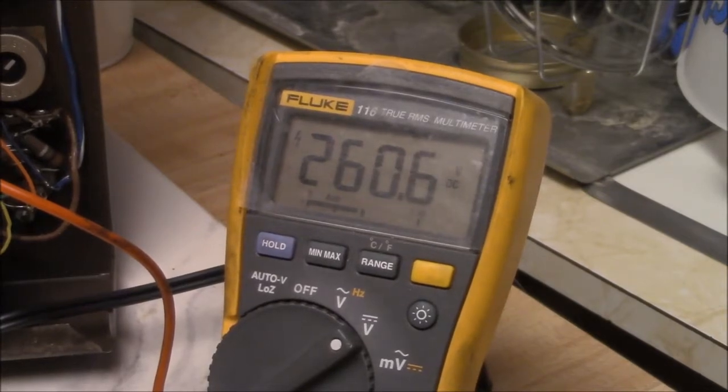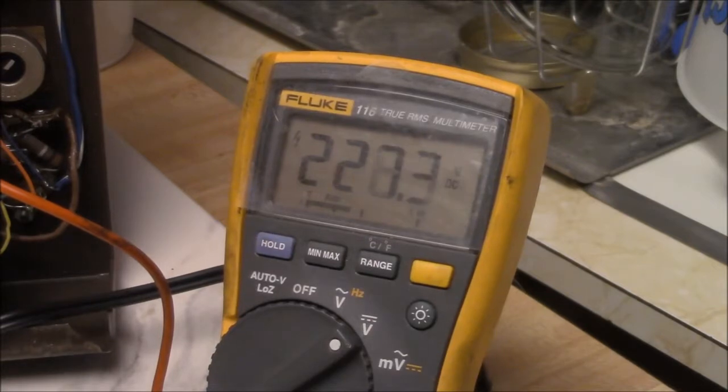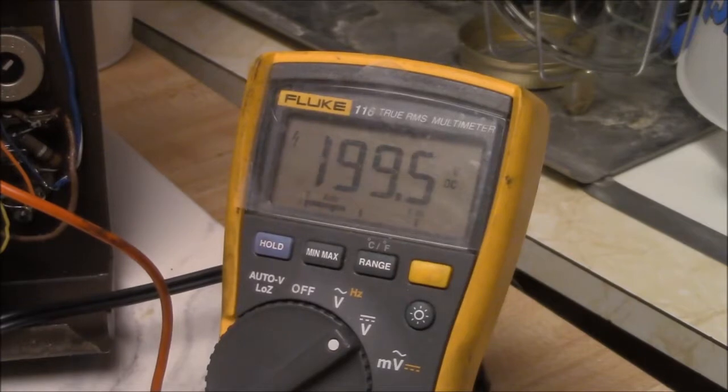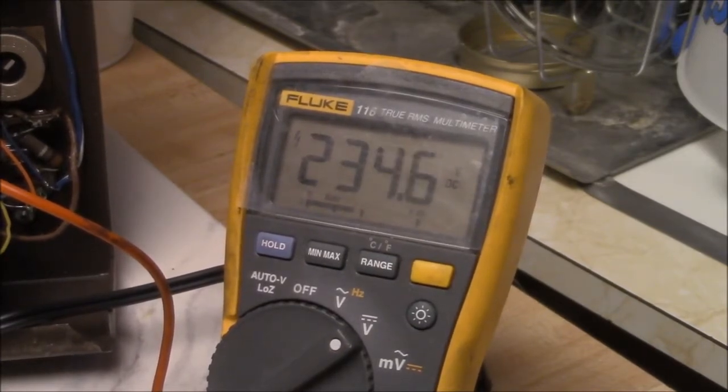It has quite a bit of DC voltage until the tube's heaters kick in and start getting some conduction. That's one thing I don't care for about this: with the solid state rectifier on the high voltage, the plate voltage to the tubes is right there, and I think that's a little hard on the tubes, personally. And I'm kind of keeping the old hand on here.